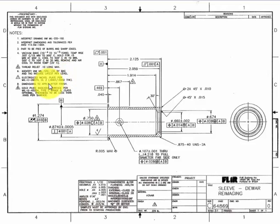Note 7. This is the one listed in the finish block. And because it is listed in the finish block, it applies to the entire part. But what it's calling for is electroless nickel plate per Mil-C-26074, class 2, 1/10 to 2/10 thousandths thick. So again, another military standard to research, and then you've got to consider, is this going to be done in-house or contracted out, and how to assure the specified parameters have been met.